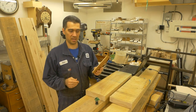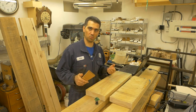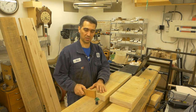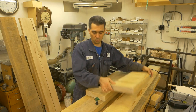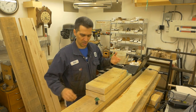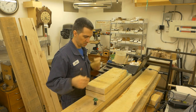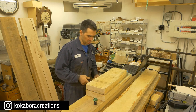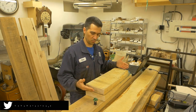With the taper I have some challenges in sourcing wood. Obviously I wasn't able to find wood that is thick enough to cover the taper — as you can see, the widest part of the taper is still above the width of this wood. So I was left with two options: number one is stacking wood together, and as we can see we have plenty for the taper, or create what I call the hollow leg by using my router bit to get four pieces of wood and join them together to form the leg.